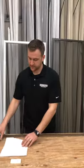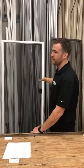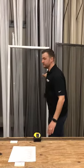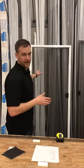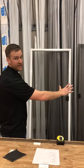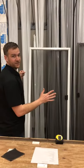The only thing you need to know after that is when you're on the outside of your house looking inside, you have to signify which side the handle's on. You need to know which is the operable and which is the stationary panel. So if I'm on the outside looking inside and your patio screen door is closed, the operable side would be the right side and the stationary side would be the left. This would be an OX door — the X is always the operable side, and the O is always the stationary side.